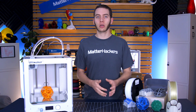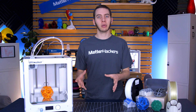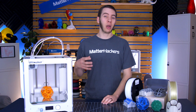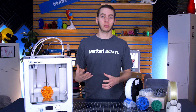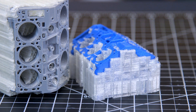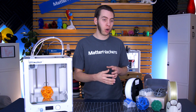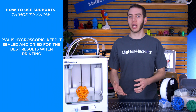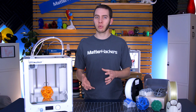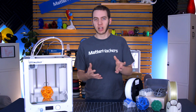One thing to note about PVA is that since it is water dissolvable, it will absorb water from the air — it is hygroscopic. So you're going to want to keep it dry by either putting it in a sealed bin, a vacuum-sealed plastic bag, or just something to keep it out of the open air. That won't exactly damage the filament where it won't print at all. If it's wet, it gets a bit more cloudy and has some complications when printing, so you may end up with a little more stringing. It's still usable, it's just better to dry it out before you print. You can use an oven or a filament dryer — just keep the temperature at a reasonable level because PVA can get like a wet noodle if it's drying a little too hot, as it starts to melt and soften.